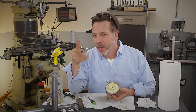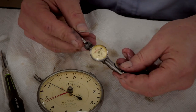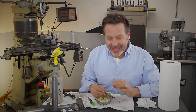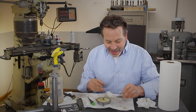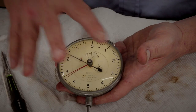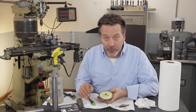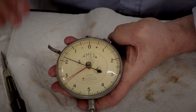The first time I did this was probably about three years ago. So here's the first one I ever did — this is a last word indicator. As you can see, it's gone through a couple of battles in its life and it absolutely didn't move at all. Cleaned it up just like I did this gauge. Three years later, it's still working fine. So again, if you've got an old beat up gauge that isn't working, it's well worth the test to just spray some paint thinner on it. I actually got a little too much in underneath the bezel and had to take that off and clean it up, which isn't that big a deal. There's just a little retaining ring back here that you take off. The thing you have to be very careful about when you do that is the numbers inside — they rotate. You have to be careful because you can damage that needle when you take that off, so just be very cautious.